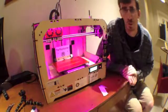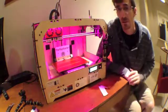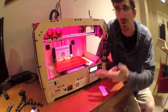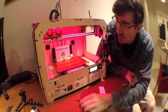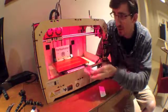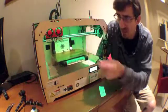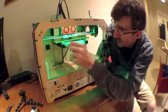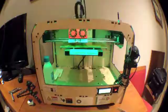We've been waiting about six minutes to let the machine warm up. The heated build platform warms up to about 110 degrees Celsius, and the extruder is going to heat up to about 235 degrees Celsius. What we want to be careful of is that the bed platform doesn't come crashing into our extruder nozzle — and if we've leveled our build platform correctly, that shouldn't happen. The other thing to look out for is drool — that's when plastic oozes out of the nozzle tip. We use tweezers to clean that out of the way. When the machine is finally ready, the build platform will raise up, the machine will set an anchor — extruding out a bunch of plastic into this corner — and now it's printing our part.